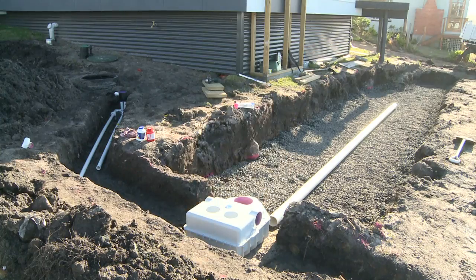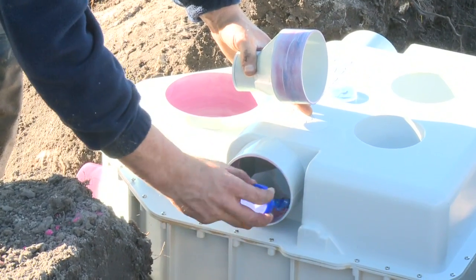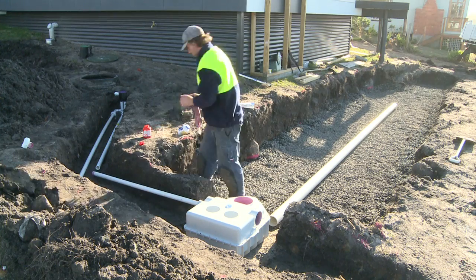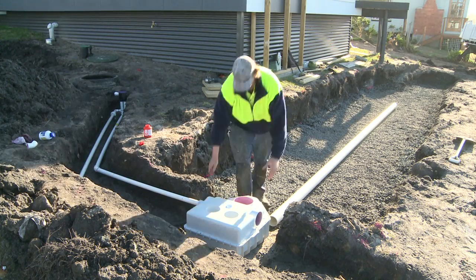The DrainWaves are placed on mortar beds so that they're nice and even, and the pipe fittings are glued in place. The gravity feed of these pipes allows the DrainWave to collect 10 litres, and when it has this amount of water it releases it as a dose to the absorption bed.